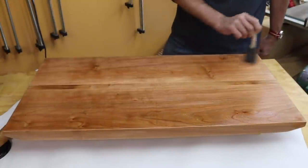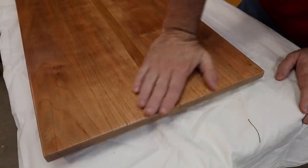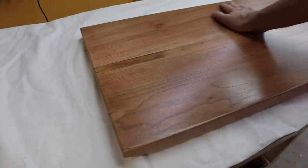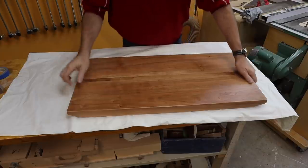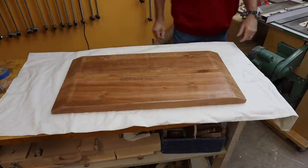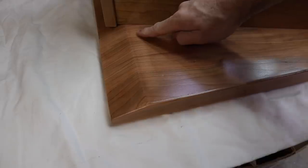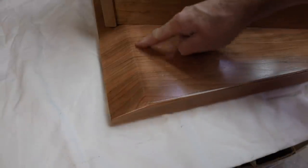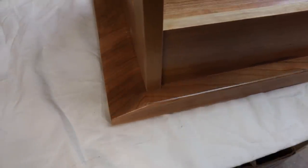Two hours and then we can get on to the second coat. And here it is after four coats of polyurethane — the color is looking so much better. So let's get it put back together. It is interesting that even after all that sanding down to 40 grit I can still see the faded marks where the base was attached, so I can just line it right back up.